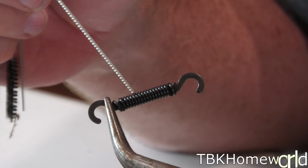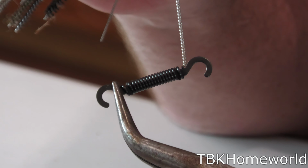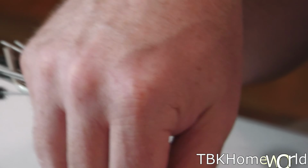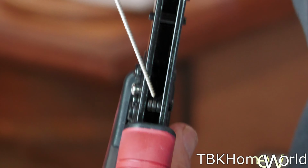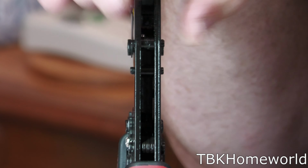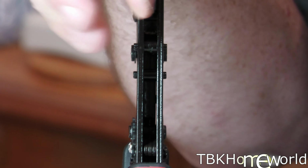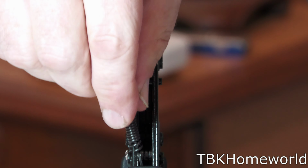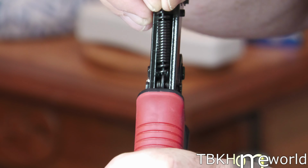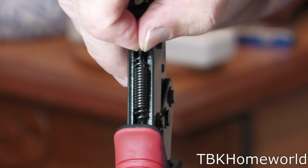They have saved money and processing by doing pieces of stamped sheet metal that have little tabs that are simply turned into the spring. These hooks then hook onto the body. And we have a hook here that one of the hooks goes onto, and if we open this up, this right here is where the other hook goes. Well, the problem with this piece is it's 3 pieces of the steel laminated together. And whenever it laminates that steel together, there's not actually a proper hook. There's just a small little lip, which at this point is okay, but as you extend this out, you actually change the angle of that, and our spring continues to fly out.